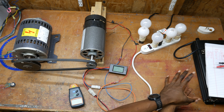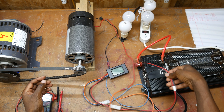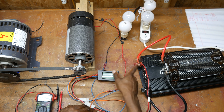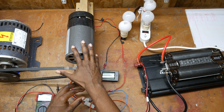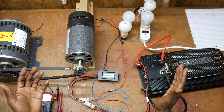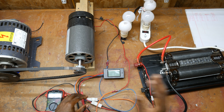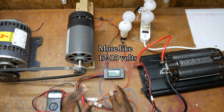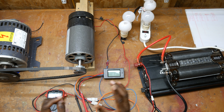This creates problems when you go to use an inverter. I now have the DC generator wired to my inverter — just positive and negative to the corresponding terminals. This is a 3000 watt 12-volt inverter. I have a capacitor on top to help smooth out the DC voltage because of the voltage fluctuation problem I showed you earlier. I've already tested this a lot and I know it doesn't work, but I want to show you anyway. The inverter is very sensitive — it's looking for exactly 12 to 16 volts. If you get even a hair above or below that range, it will freak out, start beeping, and it won't work.